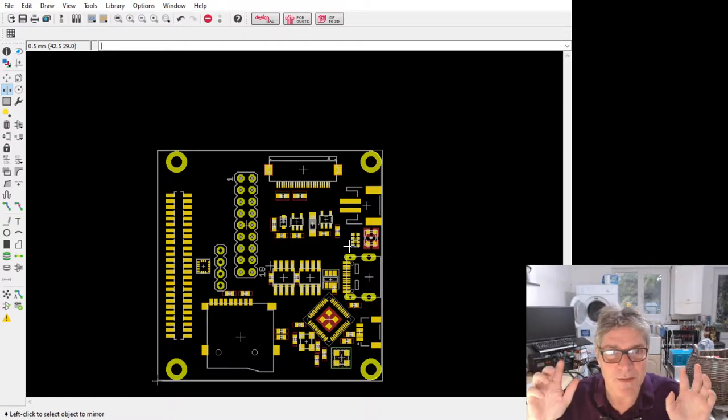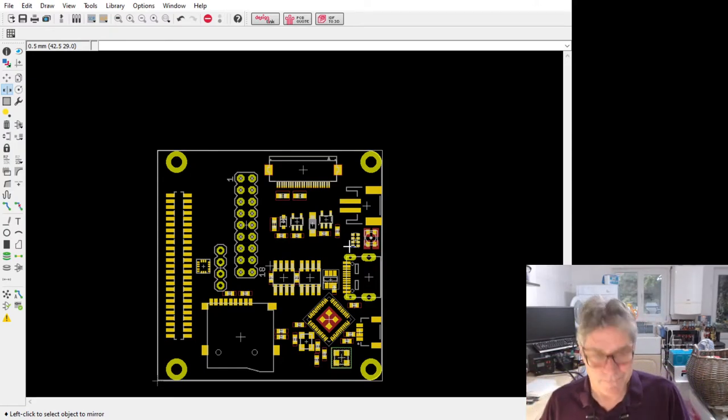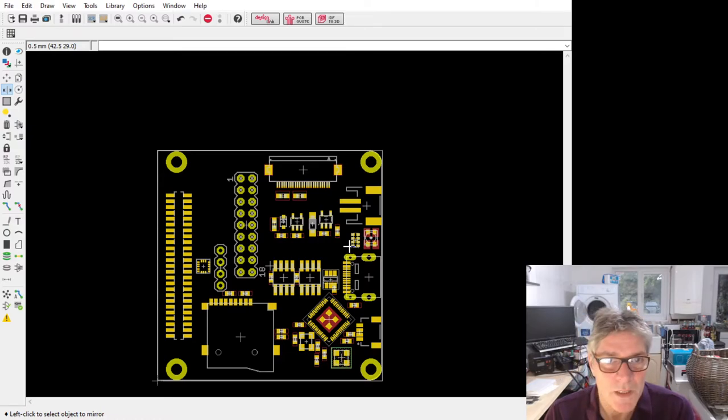So things might be slightly upside down to the way that you might expect them, but it does help in terms of construction and assembly, because it means you can do everything on one side. That means you can do it in one pass. So when you do the pick and place of the components, it's all on one side, all the surface mount parts, including the connector. Because if you have the connector on the opposite side, then it's a two pass and a double reflow, if you like, which just makes everything take twice as long or cost twice as much if you're paying someone else to do it, right?